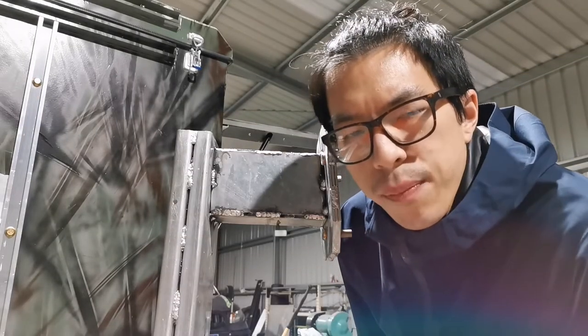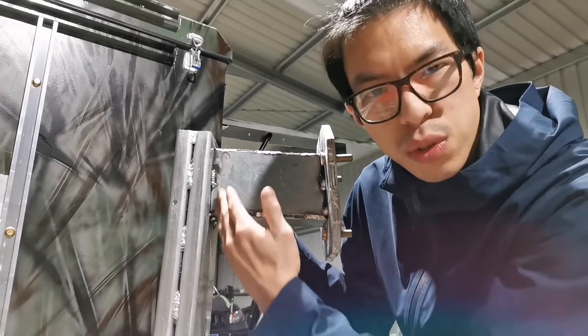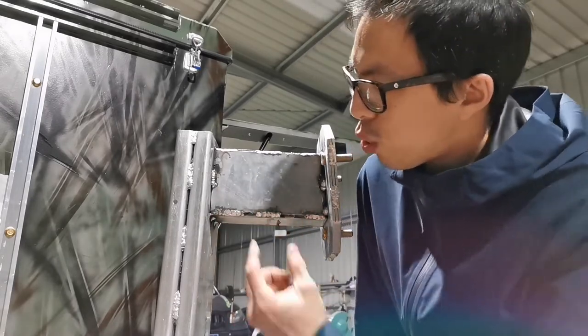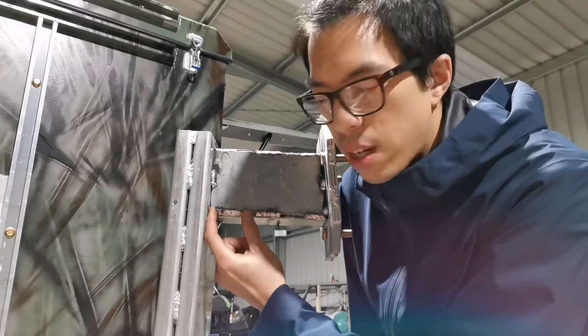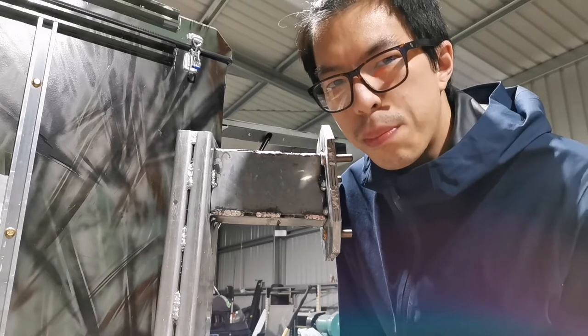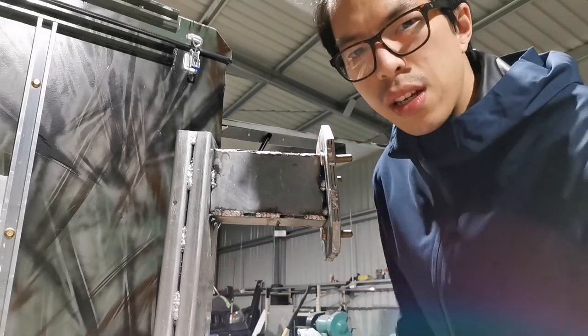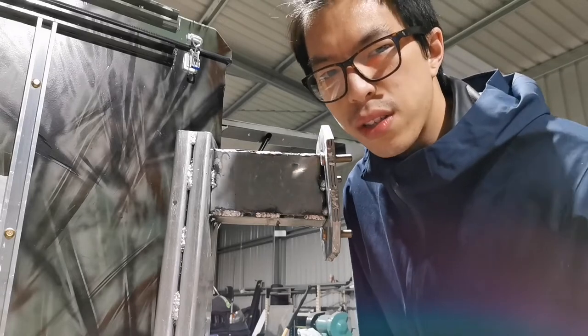So what I'll be doing is to cut this arm back out again, so bust all this weld and cut it out, and shorten the arm by this much, and hopefully the arm is a little bit more balanced, and we'll bring a tire up and match track and test fit it and see if everything goes all right.